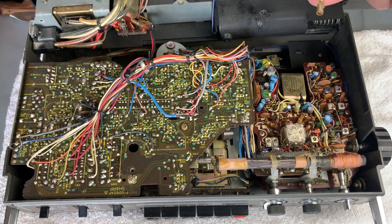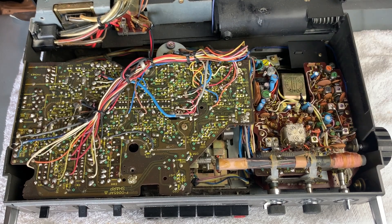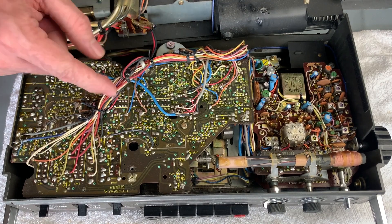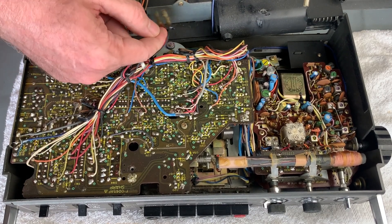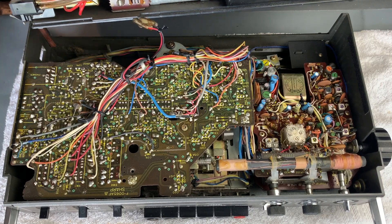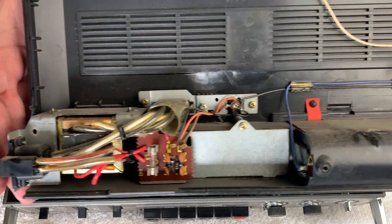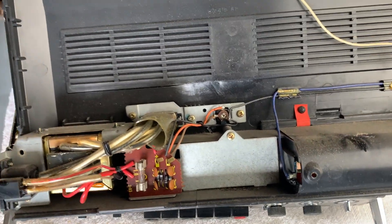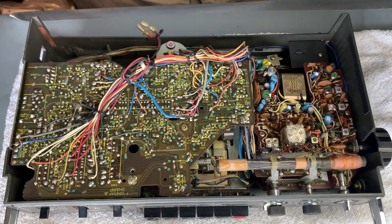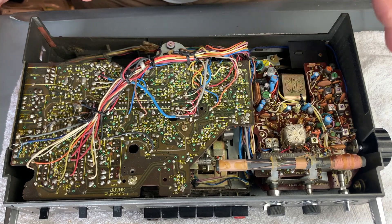There's a white cable which is your antenna, which goes to the ANT spade on the radio board. Then you've got the DC from the power unit going to the board - you'll see the black and red wires, appropriately marked with positive and negative on the back case. Once you've done that, the back case is ready to come away complete with the antenna, transformer, and regulated power supply, leaving us with the board itself.